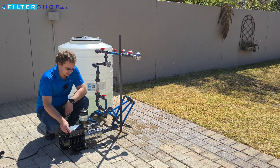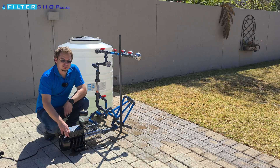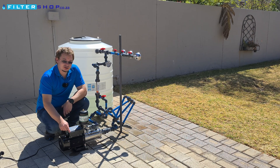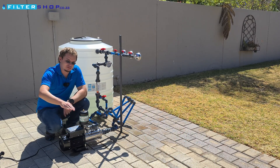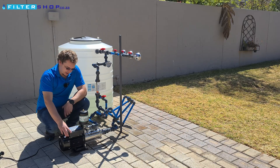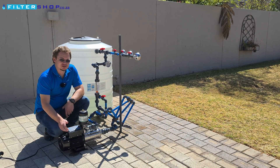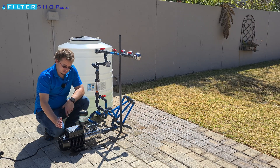It's definitely one of the quieter pumps we've tested. The one downside is you really need to bleed it properly, as we did struggle a bit to get all the air out of the pump — but in theory that's a one-time issue when you initially set it up. The controller has leak detection, and if you want to save more power, you can put a larger buffer tank in with the system and set it on the controller to allow the pressure to drop down more before the pump switches on. If I were to do something in my house, I'd use this pump with a relatively large buffer tank for amazing power consumption. It's stainless steel so you don't need to worry about corrosion as you do with cast iron pumps. Overall, I think I've got a new favourite pump.